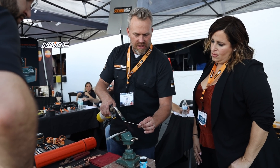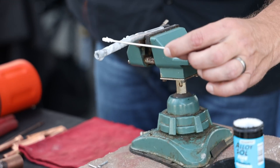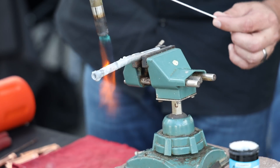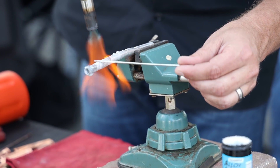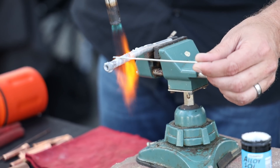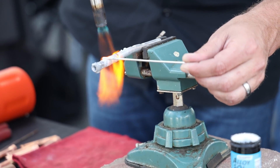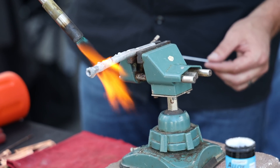So we're just going to heat the end of the rod, dip it in the flux, and melt the flux off onto our repair. Nice and easy — all we're going to do is lay that rod right there and melt the rod into our repair. Notice where the flame is right now — it's taking a little longer because it's not as hot, but that's okay. We're not in a hurry.